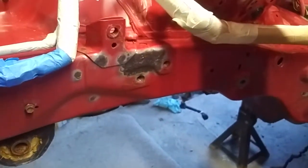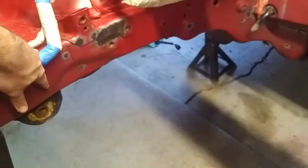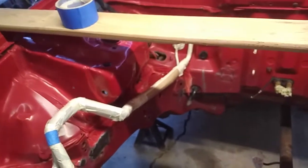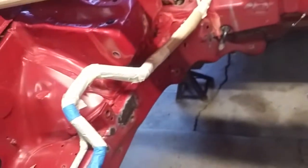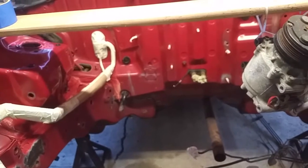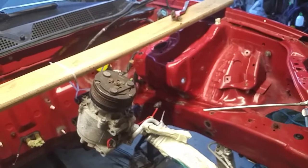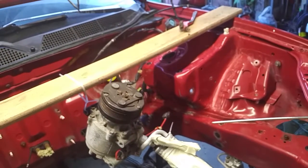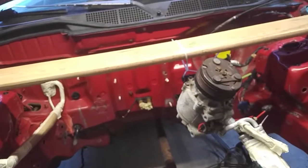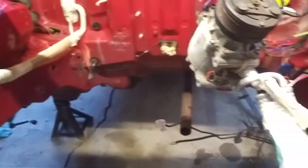I have a few rust spots that I've wire-wheeled down. Next step, I'm taking out all the hardware I left in, putting it in marked containers, and cleaning it with a vapor rust-type product — basically a dilute phosphoric acid to strip the rust off. And I'm going to have a go at doing caustic hot bluing, which involves boiling sodium hydroxide and potassium nitrate at 280 to 295 degrees Fahrenheit.